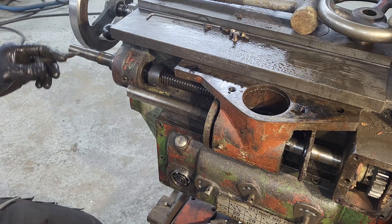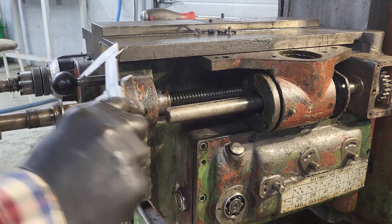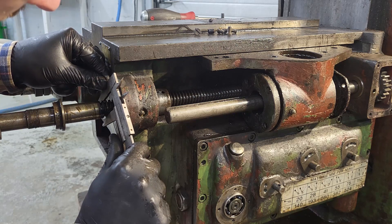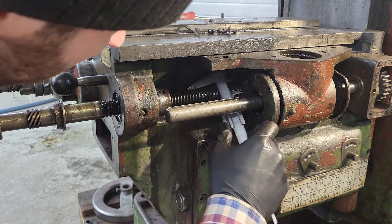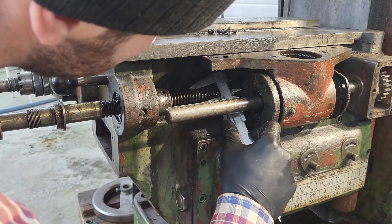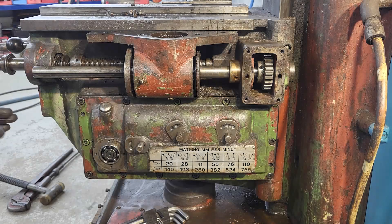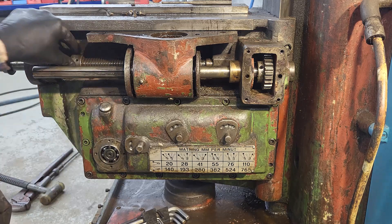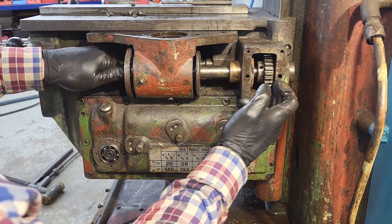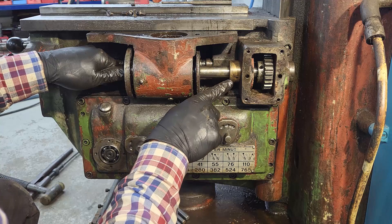I'm not sure what's happening, but something's happening — it's going out. It's 24, it's 25 — how could it move before then? So we move back to this shaft since we need more room for this nut to get it loose. We think we'll now try to pry on this gear just to push the axle in this direction and hopefully get this bronze bushing out.